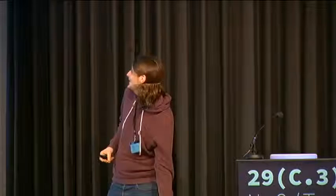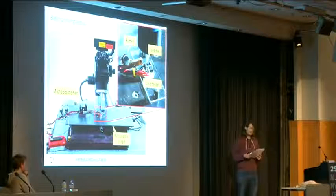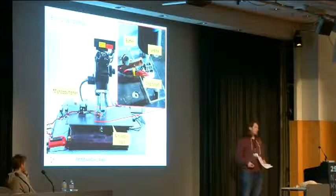There's also something important that we need. Of course, we need a target. In our case, it's a PIC 12C508A. It's a very old microcontroller. It's a UV erasable microcontroller. If you buy it in plastic package, then it's of course not erasable. Then it's an OTP version, but you can buy it in ceramic casing. It has a copy protection fuse. It's one fuse, 1-bit EEPROM memory, that if you program it, the controller refuses the readback functionality. You cannot read back the code anymore.